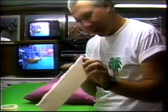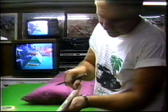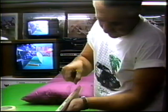Now, one of the things I just noticed, I have one of these in a little crooked. When you get one in a little crooked and it's off to the top, put the additional line to the bottom. And now when we go to set the hinge gap, or whatever you want to call it, the pocket, we can set it right in the center of that. Let me show that up on a close-up. Now see, this one out here, I have the line up a little bit too high, so I've put the line a little low, and when I cut that out, I'll cut right in the middle. When I see two lines, I'll cut right in the middle. Otherwise, I'll cut right on the line.